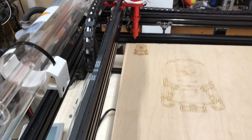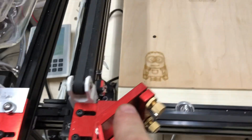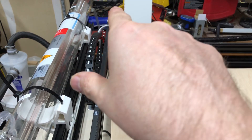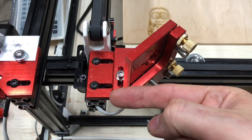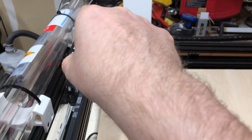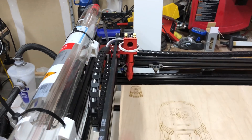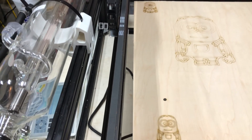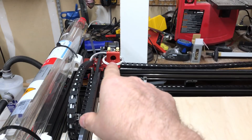Getting those tubes and mirrors lined up is a bigger pain. I did a little tweaking to get it to hit this mirror. When it started hitting too far to the right, I picked up the mirror and scooted the whole mount over a bit so it would hit more in the center. I did that after I got the line perfect, so positions two and four hit the exact same dot as small as I could get. I wound up having to re-aim a little bit because moving that part moved the mirror slightly, but once I got it, I got it right in the center.